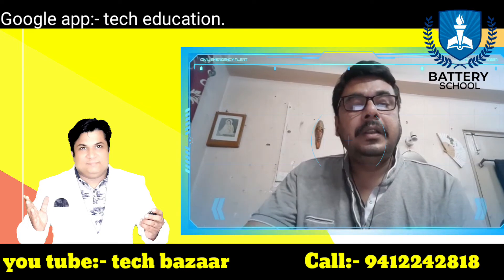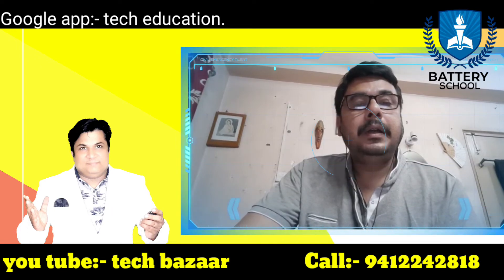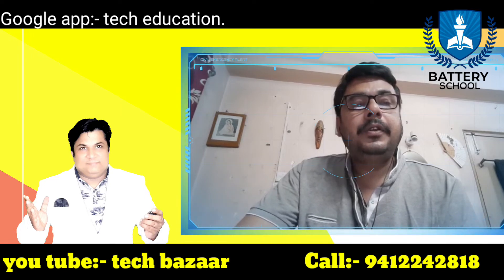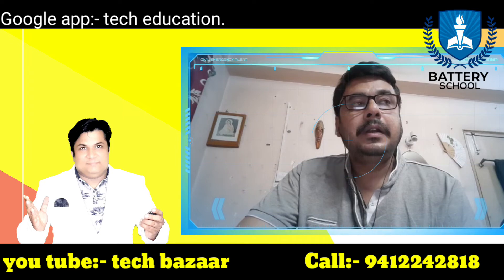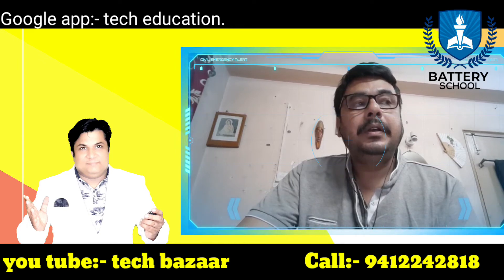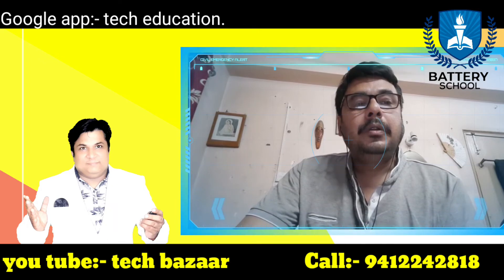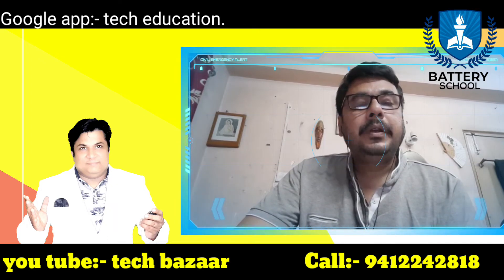If we study by microscope and XRD, we can see the crystal structure of the cured plate. The cured plate's crystal structure shows several bigger and smaller crystals that are interconnected. After curing, there is a stabilized and structured crystal formation with interconnection of the crystals and corrosion layer, which gives the plate good bonding between the paste itself and also between the grid and the paste. The curing process is therefore one of the vital processes to give a good quality plate.